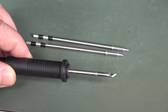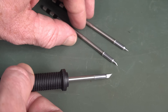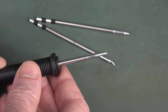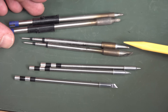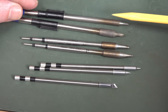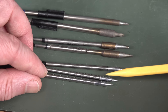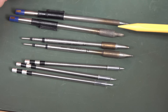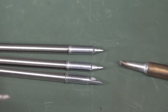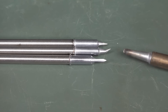The whole thing is only 80 Yankee bucks, so what do you expect? But the range of tips means this is not designed for any sort of heavy duty work — it's designed for mobile phone repair or really small SMD stuff, hence the size. Comparing to my JBC and Pace ones, they don't come in any extra thickness or high thermal capacity versions. That's just a physical bulk thing. They're really designed for small surface mount jobs, and it looks like you can't get a well-based tip for solder dragging, which is disappointing.